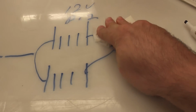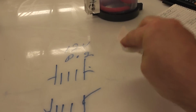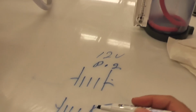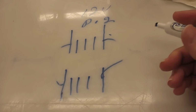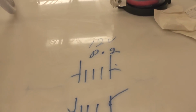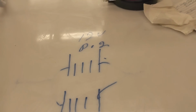So what actually happens here, I'm going to just get rid of this a little, get rid of that a little, and we're going to see what actually happens. So in an earlier video with our larger cell that we actually run the Geo on, runs off at 220, I mentioned that the maximum size of plates you need to use is 8 inches, and that's 8-inch surface area exposed to your chemistry. So that's roughly a 9-inch plate with a 1/2-inch gasket. So if you go any larger than that, it doesn't matter. If you go smaller than that, however, it does matter.